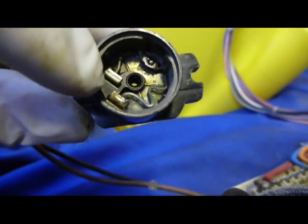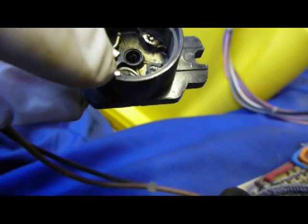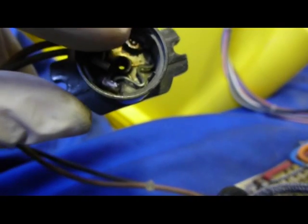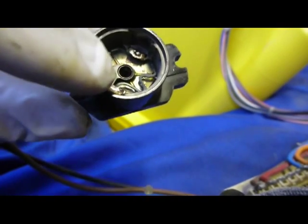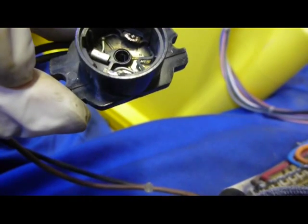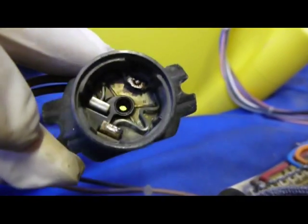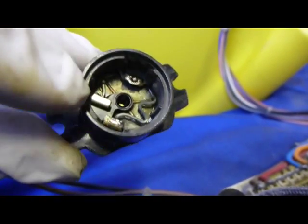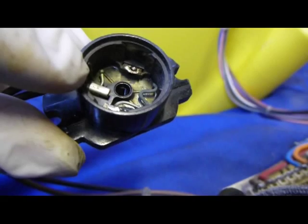Oh, sorry, okay, I'm just being dense. Yep, alright, so I think that this heater was connected through to this terminal here, which was then using the bimetallic strip to connect from here through to here. So in excess current this heater would heat up, and then the bimetallic strip would pop, disconnecting these two connections. So that makes perfect sense. So yeah, this heating circuit is busted. So what I might try and do is actually bypass this. Doesn't sound a very sensible thing to do, but I might have a look to see if I've got a fuse or something to put in its place, and we'll go from there.